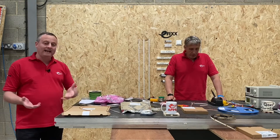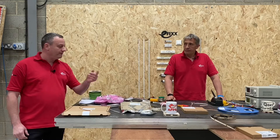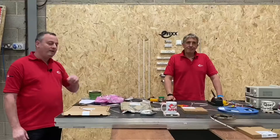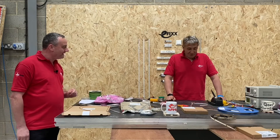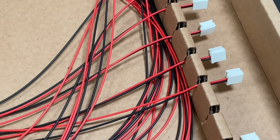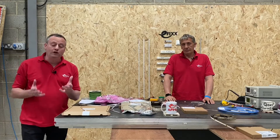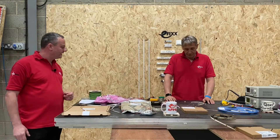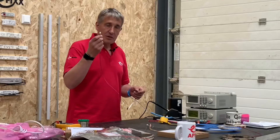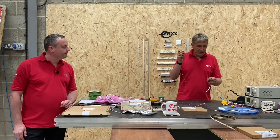So you've got two soldering approaches: on site with just a soldering iron, you tin the conductors and tin the track and you're away. Or use ferrules for a fraction easier, clean connection. However, if you want an even easier method, we'll look at the insulation displacement connector — probably the electrician's go-to connection for LED strip.